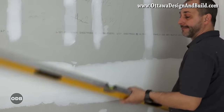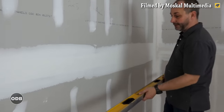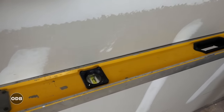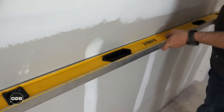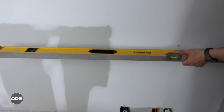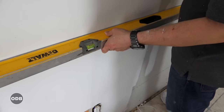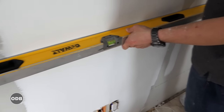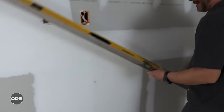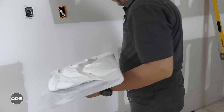I want to show you a little bit of science of what we're doing here. Here's a straight wall — nobody would look at that wall and say there's a bulge in it, right? But when I put my level up against it, it's got some comings and goings, little shadows, an eighth of an inch here, an eighth of an inch there. It's because we're building with wood. Here is my butt joint — an eighth of an inch there, but it has a little more movement, opening up to about a quarter of an inch if I push it hard on one side or the other.